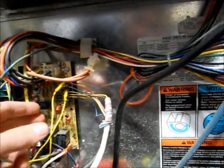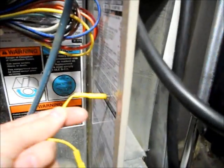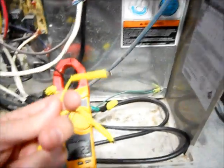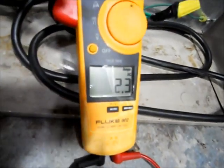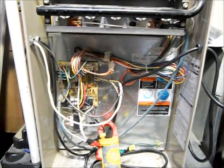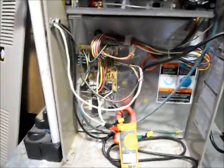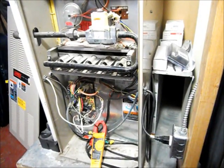Kind of zoom in on where I jumped here — I'm just going to pull that off. These are magnetic jumper wires, pretty handy, but they're a lot easier to short out. Now it's just running just the fan — 2.3 amps. Gas is off, the combustion motor is off, and now it's just cooling down to get all the extra heat out. So that's all my motor runs at: 2.3 amps. Pretty low. And with that, you can run this on a pretty small generator. Thanks for watching.